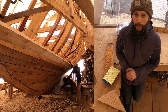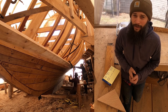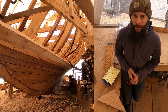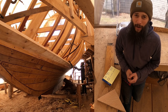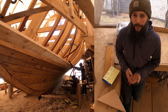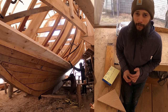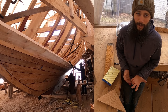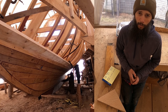If we compare that to a piece of beautifully quarter-sawn oak, these growth rings go right across the board. Tangentially, where it moves the most, is a narrow part of the board — so even 10.5% isn't moving all that far. The other thing is that the oak is below the waterline. Arabella is going to be lived on and cruised, not hauled out for six months a year. So that oak down below the waterline is going to get wet and stay wet and swell right up. The cedar is above the waterline and will go through more wet and dry cycles.